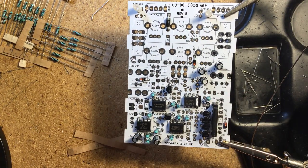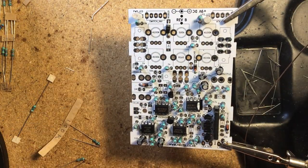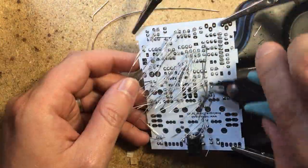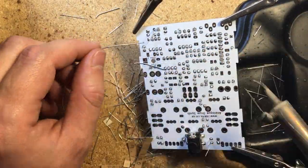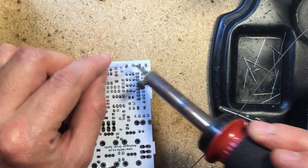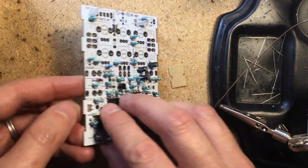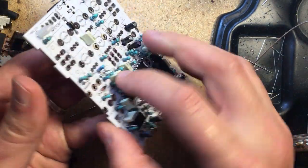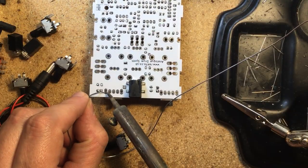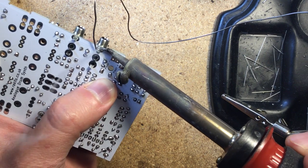Now, onto the resistors. Good thing I labeled them earlier, makes this much faster. Next come the trim pots. Followed by the film capacitors. And onto the hardware, starting with the toggle switches, then the jacks. I used the snake charmer technique for the first pin on each jack to keep them in place.